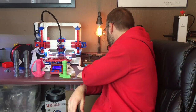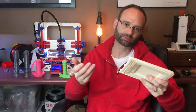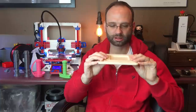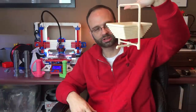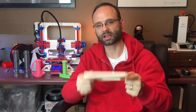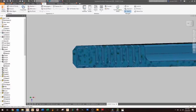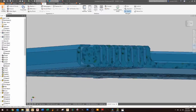So I thought, I have a 3D printer, I can do better than that. The next iteration was what I call the optimized basket, which is the same type of thing. It's printed like this and it also forms a basket. It's got some additional features, but the coolest thing is when you turn it the other way it catches itself, because there are 45-degree overhangs so it can't fall through in that direction.